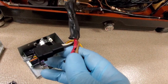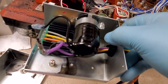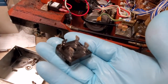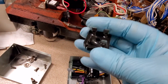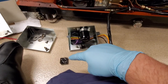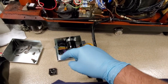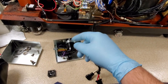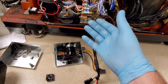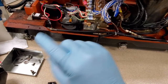So your 22-volt AC line is the one that shorted. It goes all the way down to this box, to your bridge rectifier. I've never seen a bridge fail like this. What I believe happened is your bridge rectifier — it converts AC to DC using four diodes. And diodes, like many semiconductors, they like to fail in a short, not an open — a short.